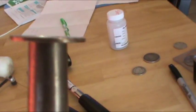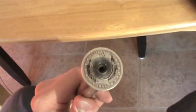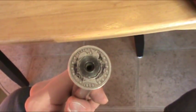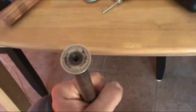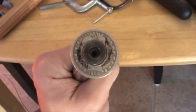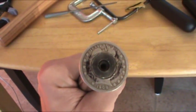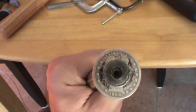Right now you can see it just barely fits on the tip. I've got to file it just a little bit more so it gets more seated so that when I start banging around the edges to fold it down, it's not going to pop off. You'll see in a lot of other videos where using a punch takes out a lot more of the coin than you need to, and then it sits further along and they just fold it really quickly. Again, the more time you take and the more meat you leave on the coin, the better the finished result. Patience is everything. Keep trying to set it on top of your mandrel to see the high points and where you need to file more. I did this with a round needle file.